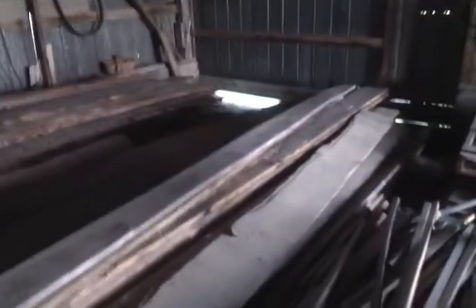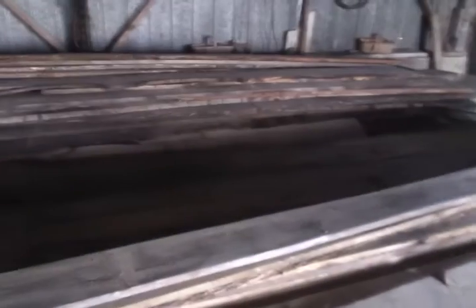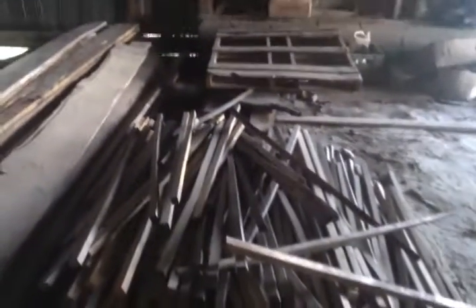At some point we're going to do some more planing. This here is more of our lumber that I sawmilled with the Wood Mizer sawmills, and our spacers right here in this little pile. Put them between your lumber and it helps air-dry them and keeps them from getting moldy and full of mildew — that's something you don't want.